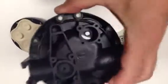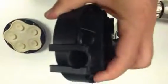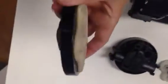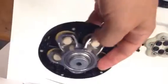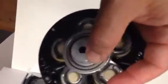We have the upper housing. The upper housing is the pump head, in this case a bypass with Aquatech quick connect ports. We have a lower housing assembly. The lower housing assembly consists of 3 or 4 pieces that are pressed together: the Santoprene diaphragm, the actual housing, this wobbler piece, and then the cam. All these parts come together as the lower housing assembly.